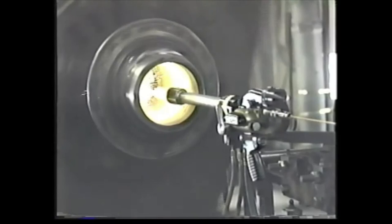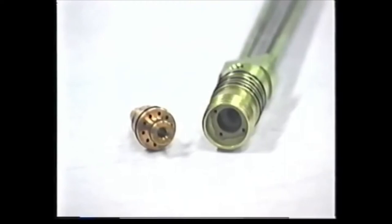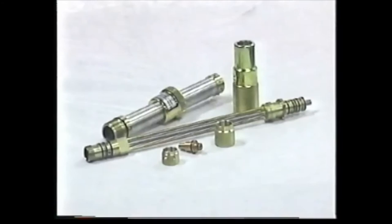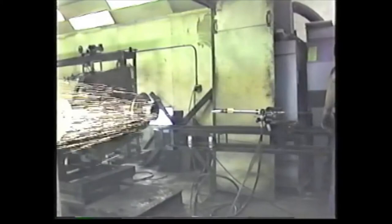For continuous heavy-duty spraying in deep holes and inside diameters, extensions are available in 6-inch, 1-foot, 2-foot, and 3-foot lengths. The same no-lap jetted combustion system used on the 14E is used on the extensions as well. They are lightweight and built for long life. The assembly consists of three metal tubes mounted inside a large aluminum shell. Wire atomizing air flows through the extension to cool it, and buckling from heat expansion is automatically prevented by a sliding joint design.